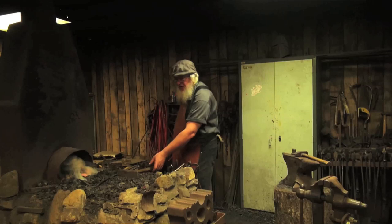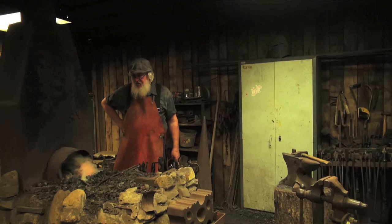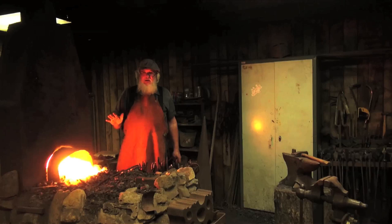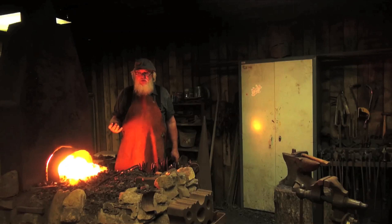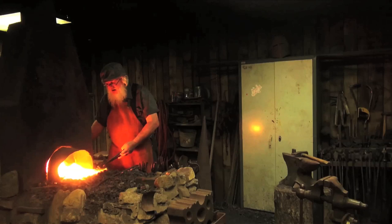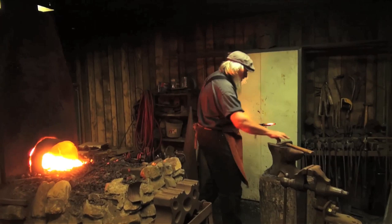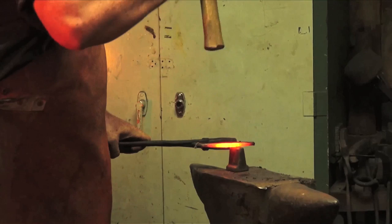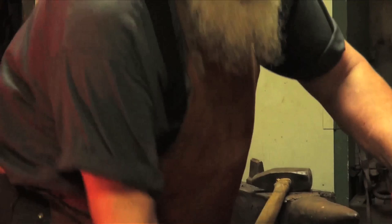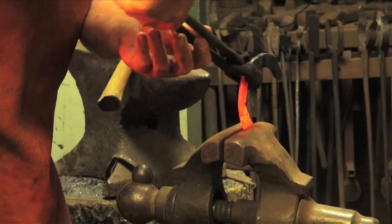There are different kinds of hardies — a cold hardy and a hot hardy. The hot hardies tend to be thinner and sharper and are only made for cutting hot steel. The cold hardies are a little stubbier and tempered to a harder temper so you can hammer cold iron on them. I don't advocate cutting all the way through on your hardy — I like to cut almost all the way through and then finish breaking it, because if you cut all the way through you can damage the edge. I'm going to lock that in the post vise and finish breaking it off. There's our piece that we're going to form our blade out of.